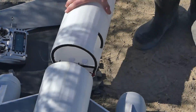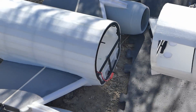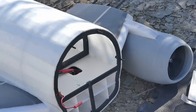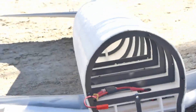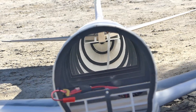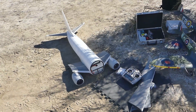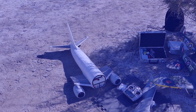The ribs are 3D printed, yeah, and that also helps give the right airfoil. So he's just going to take the nose off now for transport. There's just a few carbon tubes — you can see the carbon and the 3D printed formers. For the nose to fuselage joint there are five carbon tubes and a bolt in the middle. Very nice — that makes it really compact. Oh, that's really, really good.